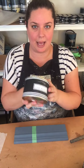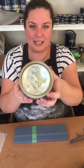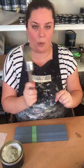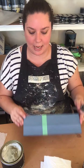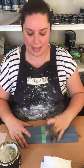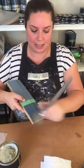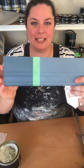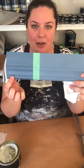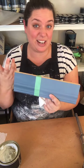I've got my clear wax — the Artisan one — it's really nice, brushes out really nicely. I have my wax brush and my lint-free rag folded so it's nice and smooth. For the first part, just your standard clear wax: put some wax on your brush, brush it out in all different directions, and wipe the excess off. Super simple, super easy — you can see it deepens the colour. This is the true colour and this is the unsealed version.